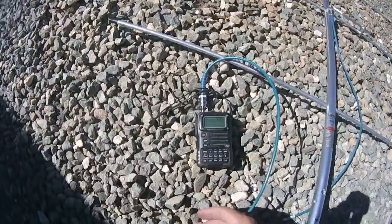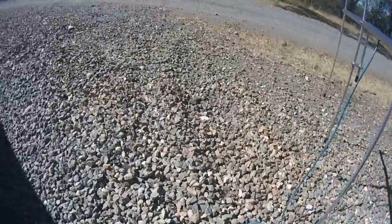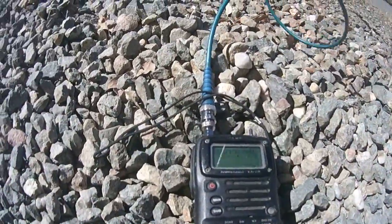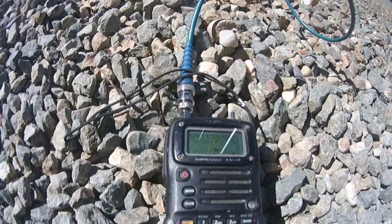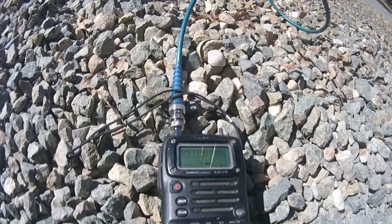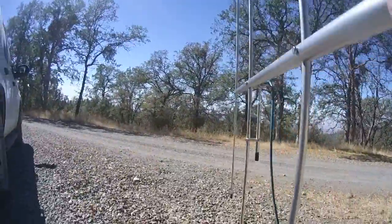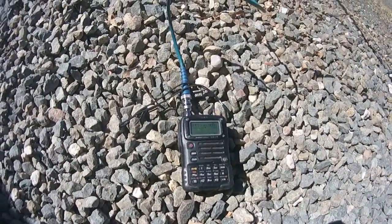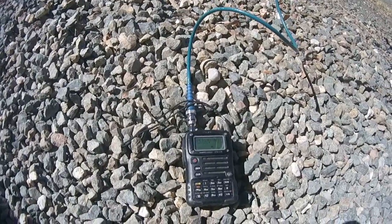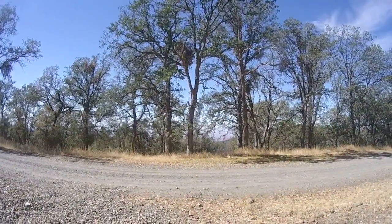Here's the VX7R. I'm just going to scan — I've got a good strong signal from my scanner of that signal. As I point to that location there, you see the number one come up on that little blip there. That's my interference signal. This Yagi is pointing right towards that location. So I'm going to move to the left — you can see it got colder, lost my signal. There it is, it came back again. I'll go back to where my strongest point was — right in that direction towards the valley floor.